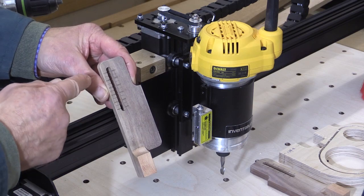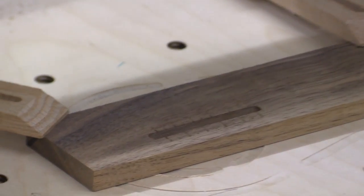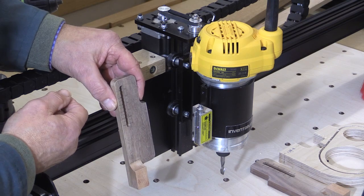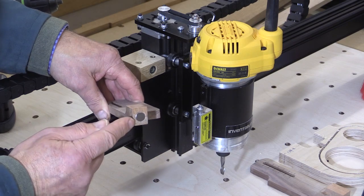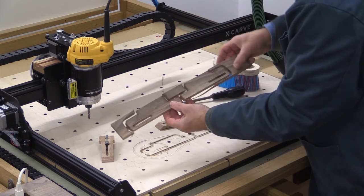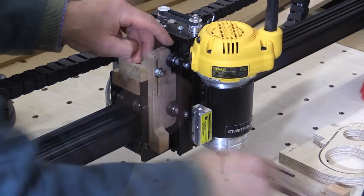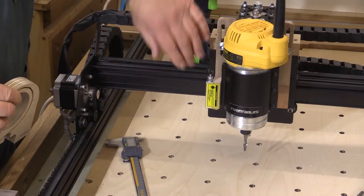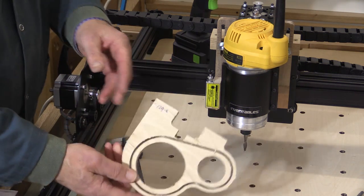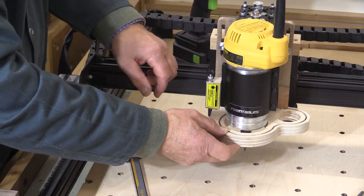The way this is constructed is very simple. I've cut this slot here which allows it to move up and down. There are some markings down here which allow me to judge the height and keep both sides level. I've got a little thicknessing piece which allows me to put a magnet in the base. There's some shaping here which allows the whole thing to fit in place without interfering with anything else on the carriage. I have a similar mirror image for the other side. So I've got my two adjustable slides in place — they can be moved up and down and they've got a magnet underneath. The actual dust boot would have a pair of magnets, one on each side, and it would go up and make contact with the magnets and be held in place.